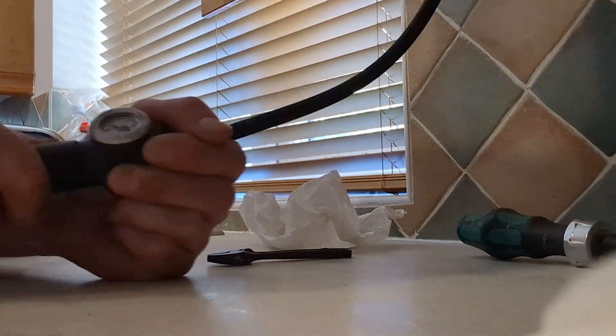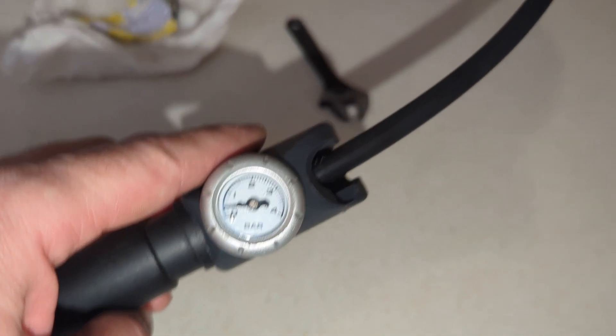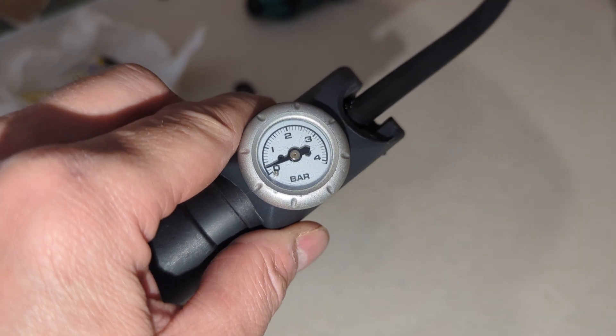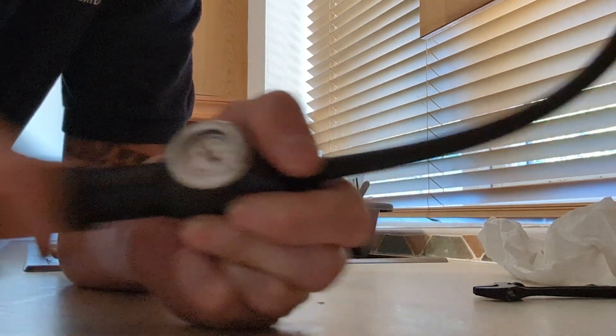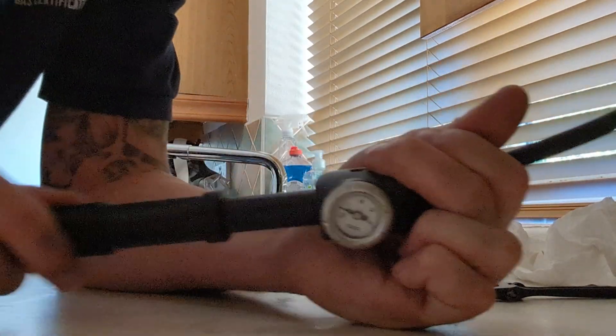The bucket's empty. I've actually forgotten to open that tap again, and that is why you can see the pressure's going up on the boiler — as I've pumped the vessel up it's creating pressure inside the boiler. I've just opened the tap again to let the pressure out, and you can see I still need to put more pressure into the expansion vessel — it's really taking some pumping up.